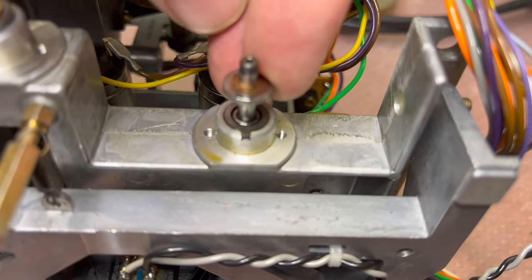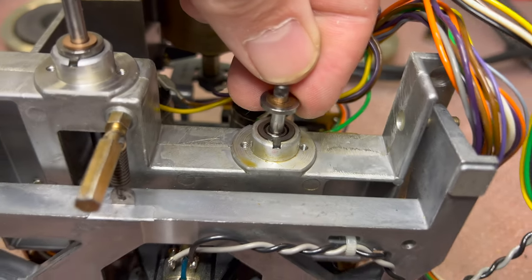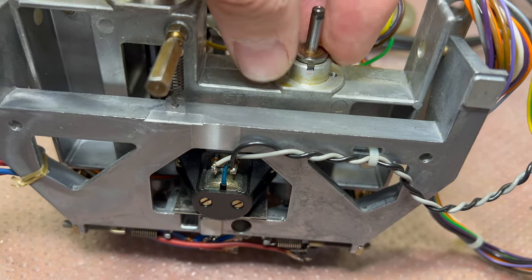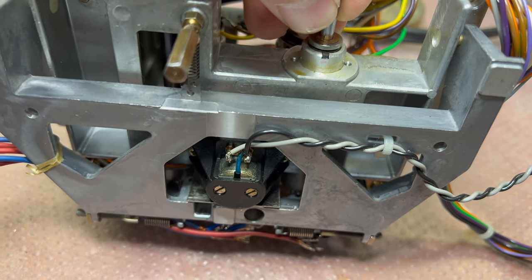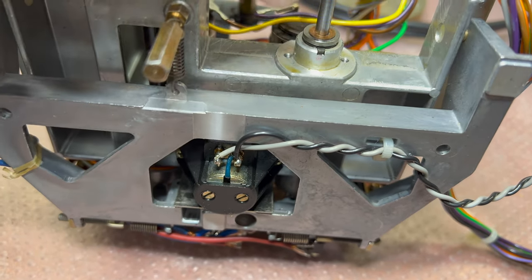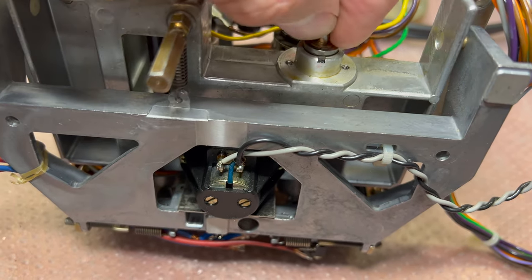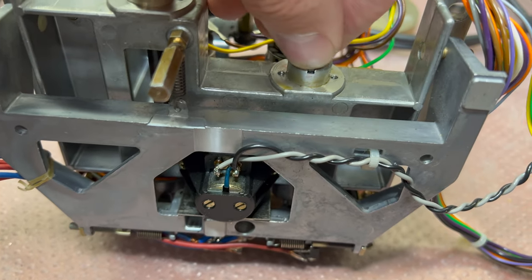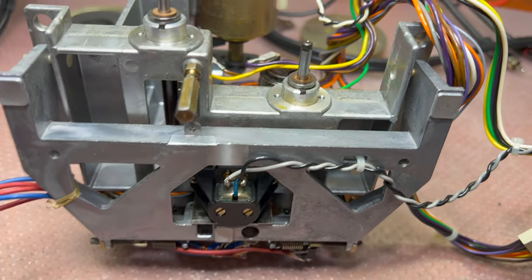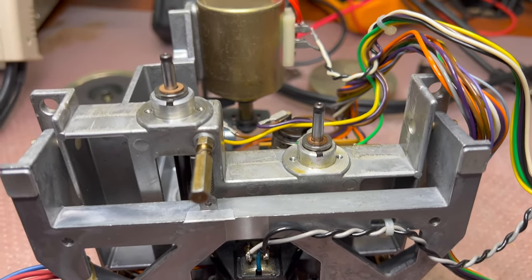While assembling I made one more observation: you see this ring with teeth — it has one side painted. The painted side should go down, not up as I assembled it last time. The shaft doesn't touch and has no position contact with the large ring with ears, meaning it should roll between the two spacers and that ring for low friction. Last time I assembled it improperly.